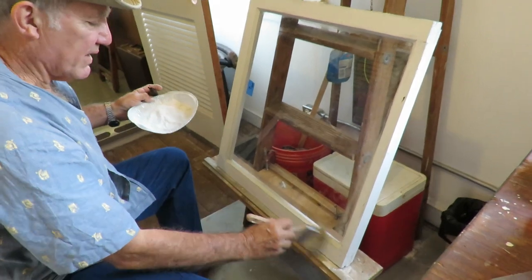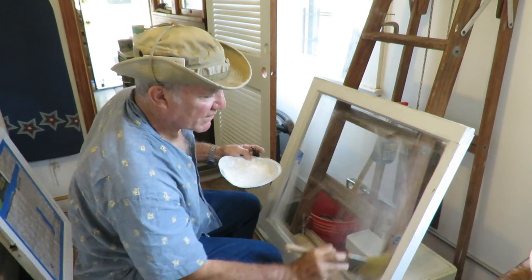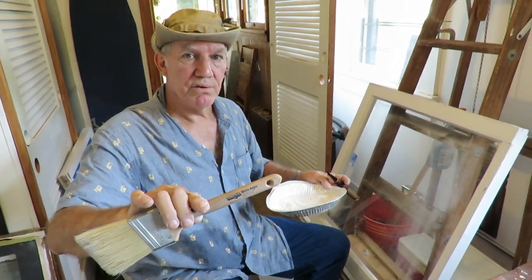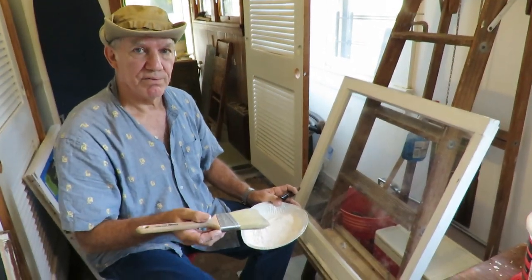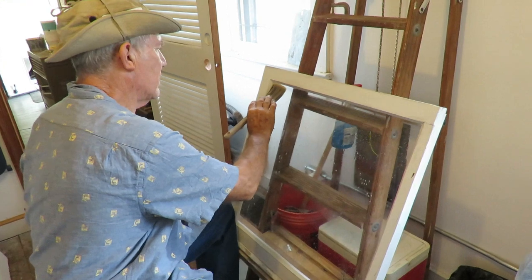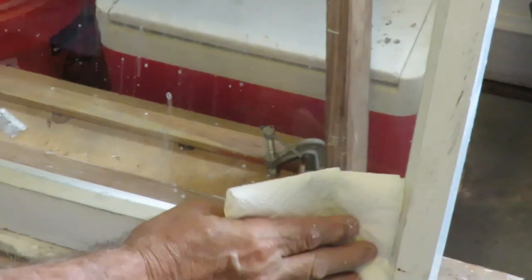We'll twirl it around and make sure the corners are nice and tidy. What really sets you apart with glazing is how neat your corners are — you want a nice sharp miter. I'll go around the edge with this whiting powder, which will actually pick up the oil. This is a Corona bristle brush made right here in Tampa, Florida. For anything you have to reduce with a solvent, you want to use a bristle brush. I'll put some Windex right on that fresh putty and very carefully go around the edge of the pane I just glazed to clean it up.